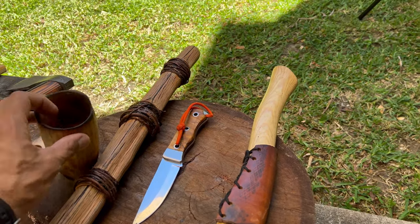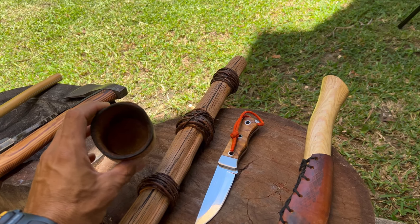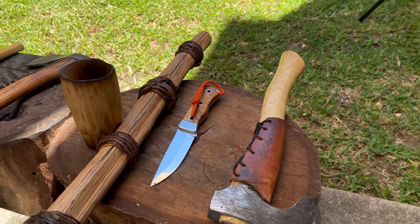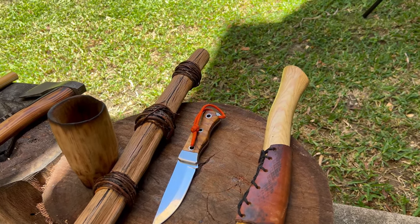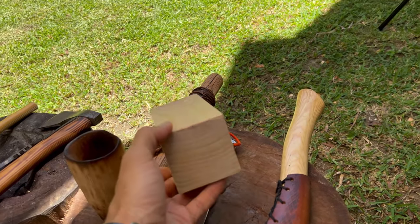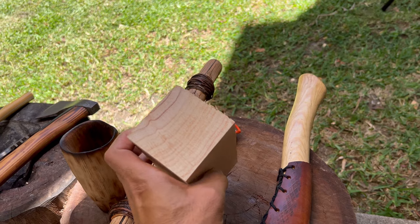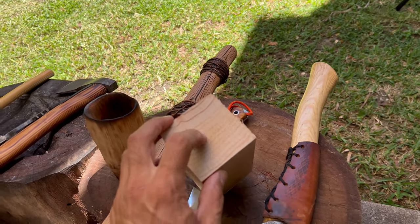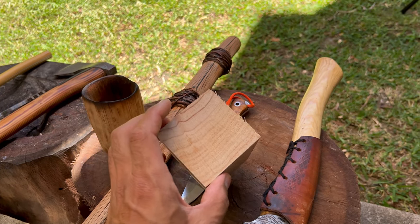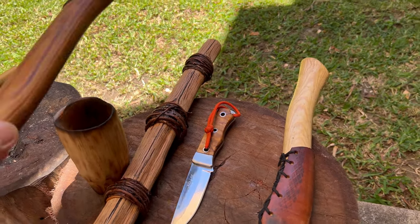That's what I had to make this cup. The point of this knife is quite sharp — it's got a sharp bottom that is probably not ideal, but that's all I had and I had to make do. Today I don't have a log of pine but I do have this block of 70 by 70 untreated pine that I will carve out. When you're looking for wood, ideally you don't want any splits in the grain — you want it nice and sealed, no cracks, because that's where the cup will leak.